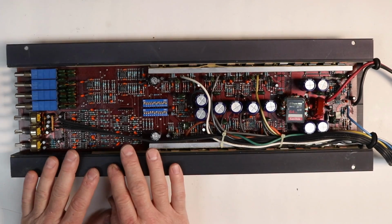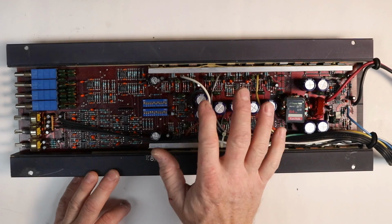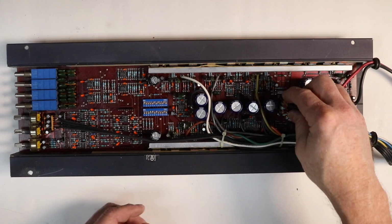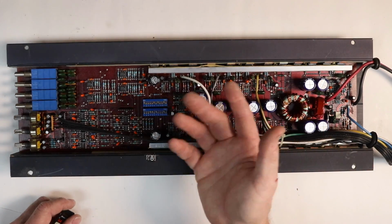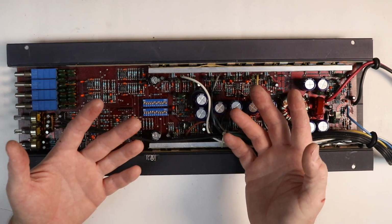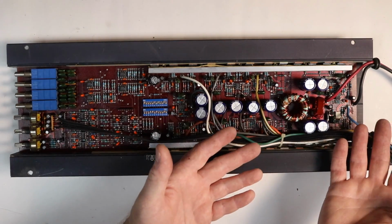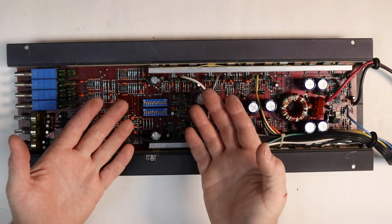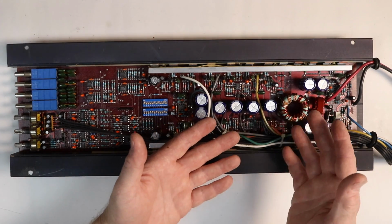It's huge, right? This amplifier, as far as power went, 620 meant it's 6 channel by 20 watts. That's it. That's all this guy put out. Of course, that's at 4 ohms. And these were supposed to double their power when you got them down to 2 ohms. Conceivably, it would be 6 by 40. I had one of these, and I had the 420 version of it. And the reason I had the 420 version is because the sub channel on this sucked. I actually could have gotten away with having 2 420s, but I'd bought this first and it just didn't work for the subwoofers very well because of that volume problem.